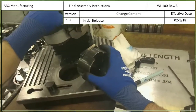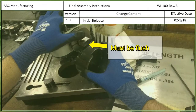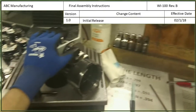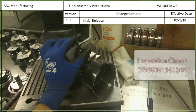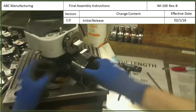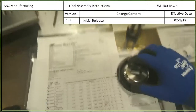We bring the tool holder up and since it's a rectangular tool, we want that to be nice and flush. From there we tighten it with an Allen wrench. Then we're ready to move on to the die.